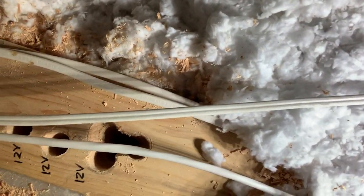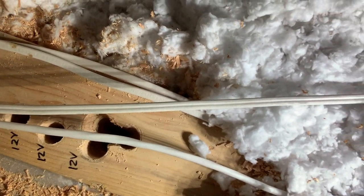See if I can get that for you. Brought in our primary voltage, just labeled everything, 12 volt holes. We wanted to do that because in the future he said he's going to end up wiring more of them. So we made him enough holes and cleaned that out, so later that'd be easy enough. Usually one circuit is accommodating for quite a few motors. That's based on the load, so you have to do your load calc on that. With this, we only have six of them.